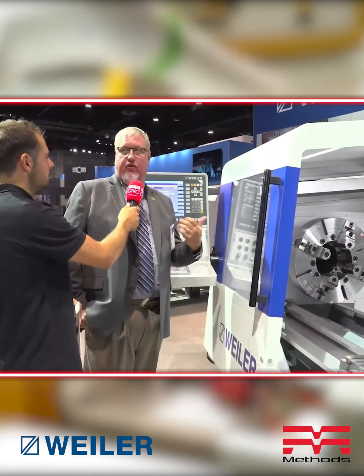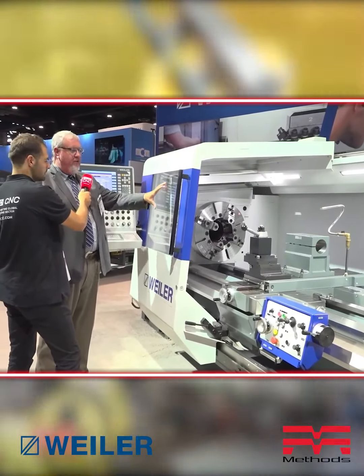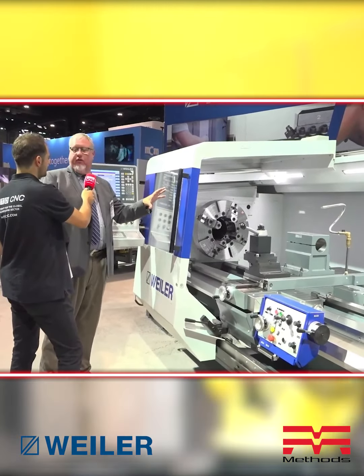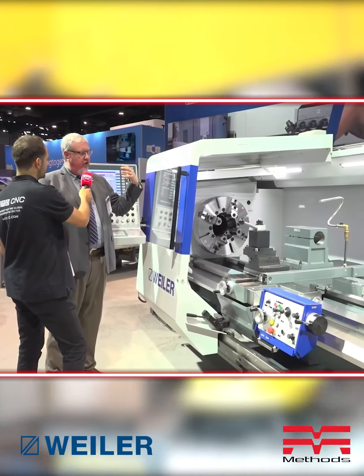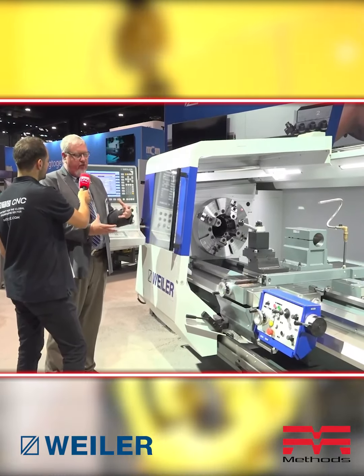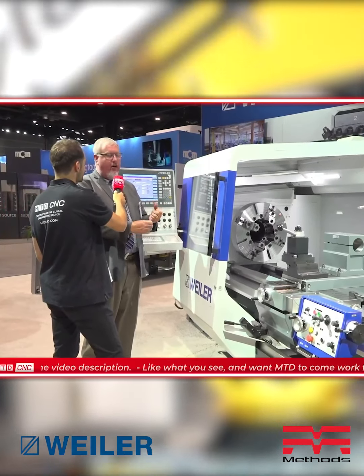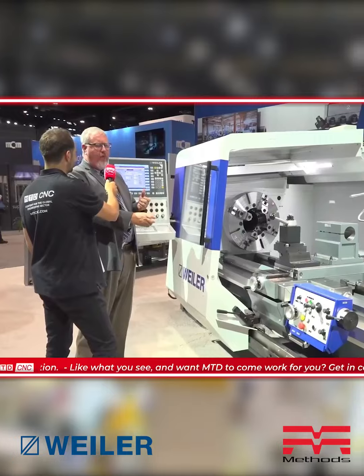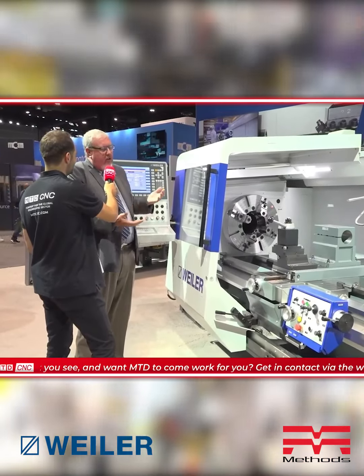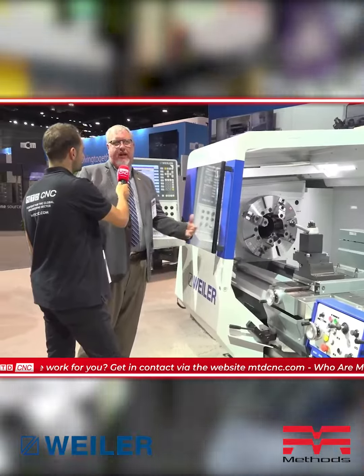The machine is very prominent with non-magnetic materials like Inconel and stainless steels — the harder-to-cut materials. It separates itself by being able to do deep boring on very hard metals and recut threads that have been down-hole, which may be hardened in areas where they were torqued down. You can move the RPM up and down while threading. There are a lot of features that make it valuable in those industries.